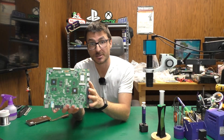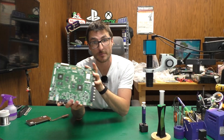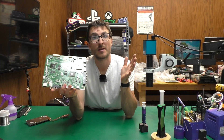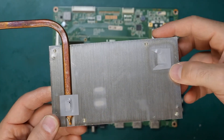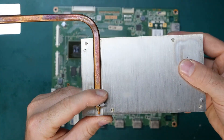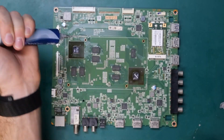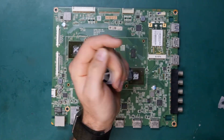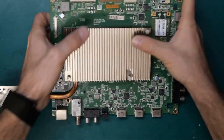Before we live test the circuit board, now that we have reformed the solder bonds between the chips and the PCB, we're going to reinstall the heatsink — but we're going to upgrade the thermal dissipation between the heatsink and the processors. We're going to remove the pads that were there originally and instead use high-end thermal paste MX4. This is going to help increase the heat transfer between the processor dies and the heatsink. And it looks like I have good spread, so we'll go ahead and lock in the heatsink.